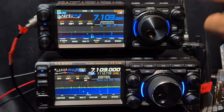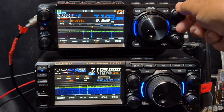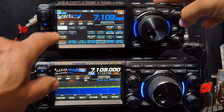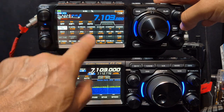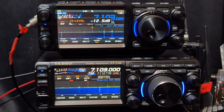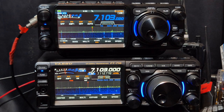What it's done is pretty effectively almost the same as what I did with the D-level setting. Let me just show you where that is — on both radios it says D-level. Tap that and with the function knob it's basically like a waterfall gain. So now, what is the massive difference with the averaging? I can still use the function knob here to play around with the waterfall gain.